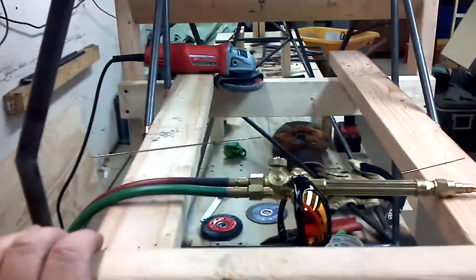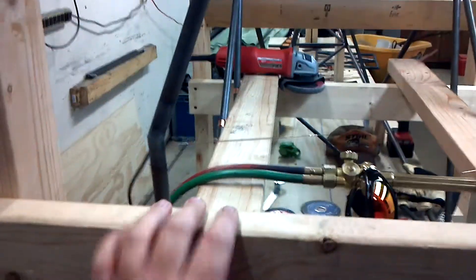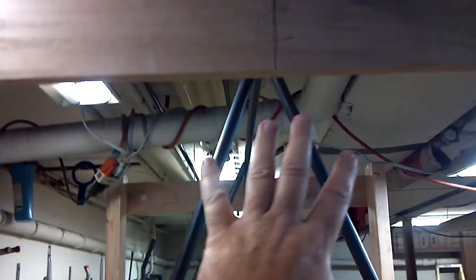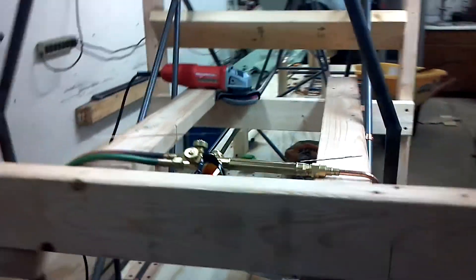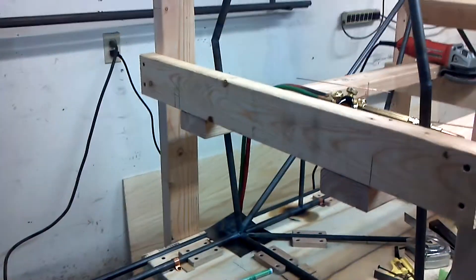This whole structure is really rigid. If I were to push on this, the whole table moves — that tells you just how strong this fuselage is. But if I put a bridge across here, I'm creating a triangle and that's going to protect my joints up here from moving. Once I have that and I know I'm protected because of that triangle, then I can start moving out here. Let's go.